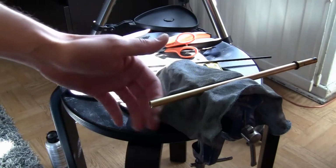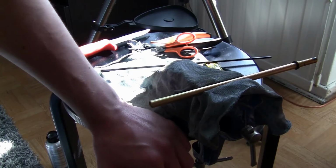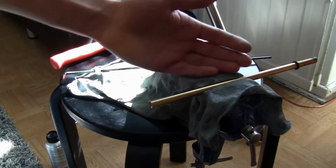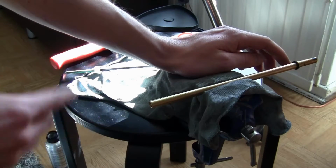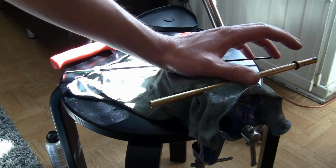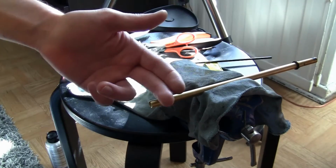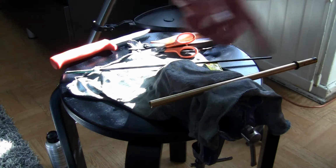So in airsoft guns, some people have done polishing in a different way. They attach some rod to their drill and then run some cloth or even sandpaper inside the barrel to smoothen out the inner surface. But there's a problem with that: when you have a drill removing material, you create these whirls in the barrel, and effectively that's like adding micro rifling in your barrel, and there's no way to guarantee that you're removing perfectly the same amount of material on the whole length of the barrel, so you get actual bore inconsistencies throughout the barrel, so that's not very good.